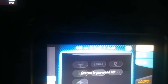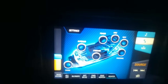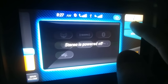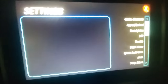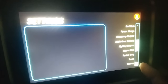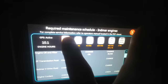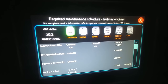The last thing to do is go into your screen. You'll want to click on the settings screen — where you control your lights — and then click on settings in the top left-hand corner. From there, scroll down through your options until you find the word 'service.' I found it there, now I'm going to click on that. You can see that my 10 to 20 hours says service needed and it's in red. I'm at 10.1 hours. I'll click the button saying service is done — now it's in green. You can also see that my next oil change will be required at 75 hours.